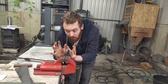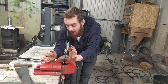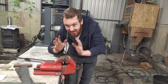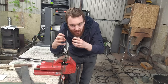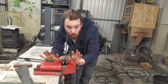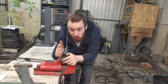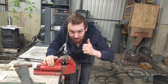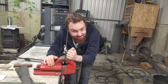I've got a little more time because the core is made from NC6 steel. This steel is cool because it takes a little longer to create all of the martensite inside during the quenching. So I hope that everything goes well, and I'm not going to lose this blade completely. So, to the oven, heat up the oil, and the big moment.